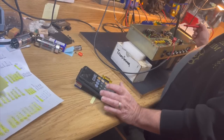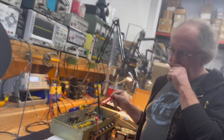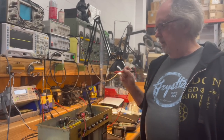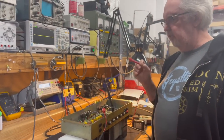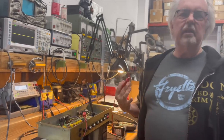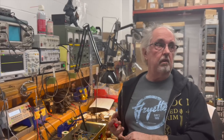378.045 times 378. 17 watts. So the power tubes are idling at 17. There's no crossover distortion, which means that you could crank the bias a bit and introduce a little bit of crossover distortion, but it's not really necessary because they're KT88s. They can handle like 20% more dissipation than an EL34.